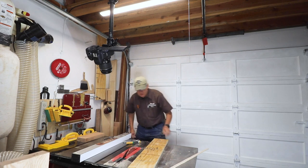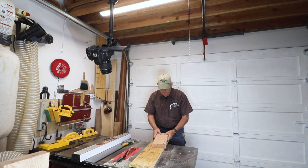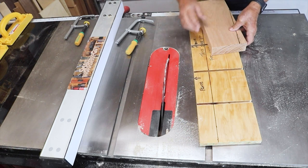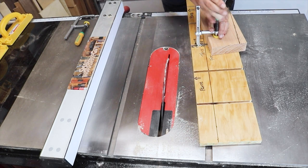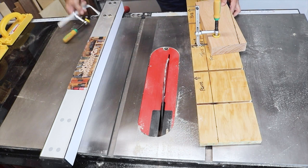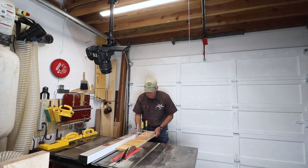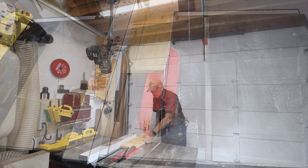The third use of this jig is as a tapering jig. I'm going to taper this piece of red oak. I marked it with a dark marker so you could see where to align it with the board. I hold that in place, insert my match fit dovetail clamps, and tighten that down. I take it to where I want it to just touch the board, move in the other clamp, and tighten that down. I'm ready to go. I bring it over to where it's going to just touch the blade but not be pressed against it — nice and slippery — then pull this back a smidgen.